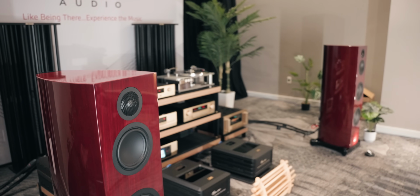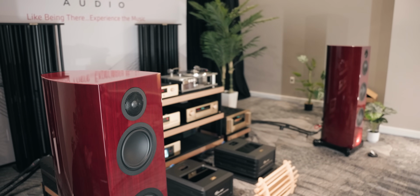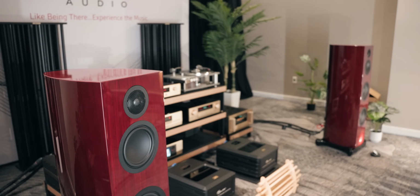And then you set it up, listen to it, measure it. You always have to make some changes because it's just the life of these diaphragms. They have their own life. They have some resonances and all these things you have to compensate, but that's why you have to sit down and listen with your ears in the end. And this also takes weeks and weeks. Three or four people sit there, listen to the speaker with different kinds of music and find out what can be better. Make some criticisms, make some measurements again, try a little bit of this, a little bit of that, but the whole basis of the system is fixed.